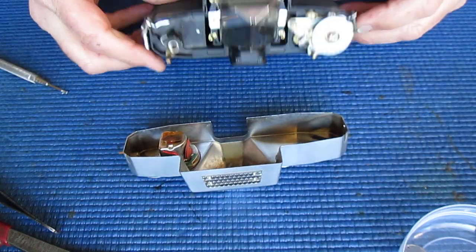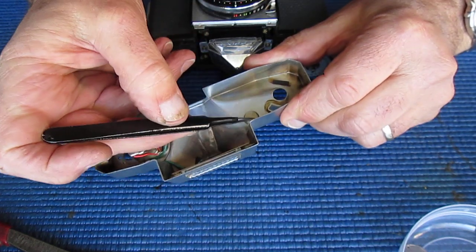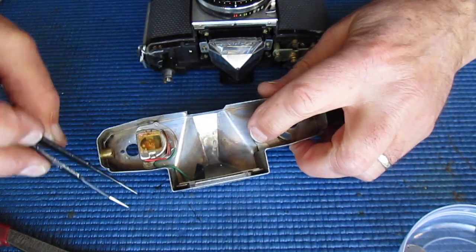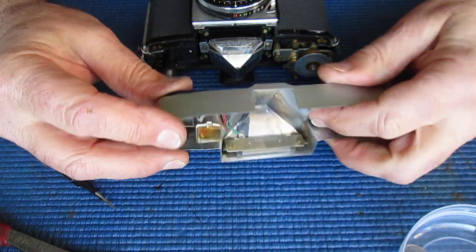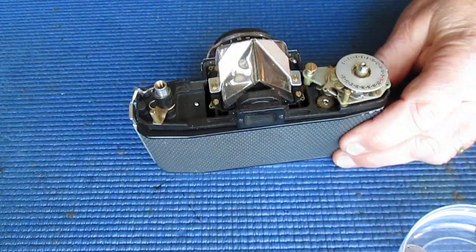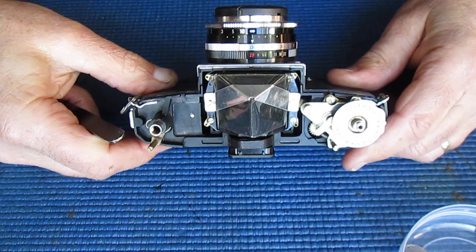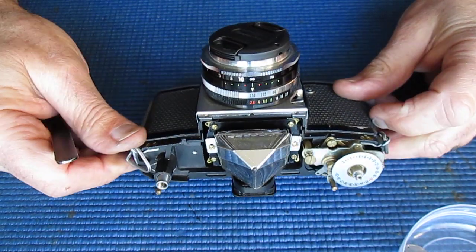What's loose here? There's our shutter release button, just sitting loose inside the top — that's a two-piece arrangement, with the inner piece being pressed down when you use a cable release. There's our top cover. It has a built-in selenium meter, which in this case is a little bit dead, as selenium meters tend to be. There are four screws that appear to hold the prism and probably the screen assembly on top of the mirror box — we can leave those for the moment and turn our attention to the bottom of the camera.